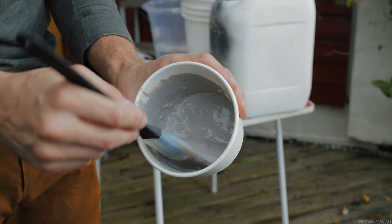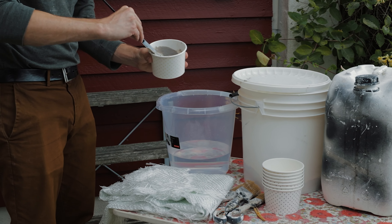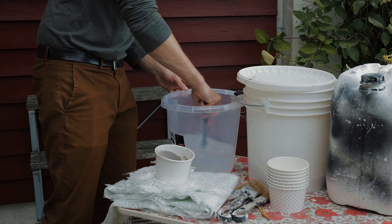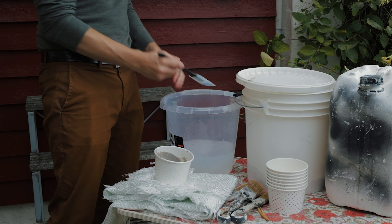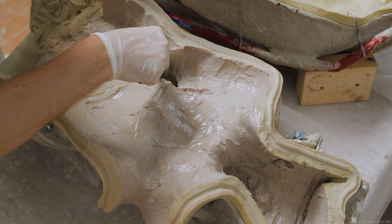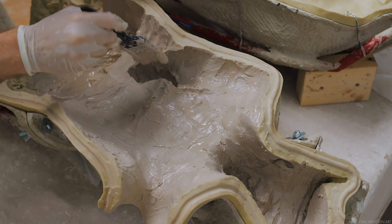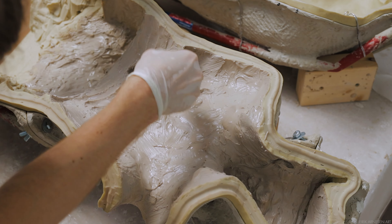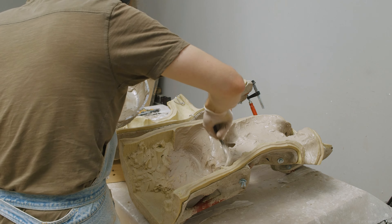You'll notice that in this video I'm not wearing a mask or other safety equipment other than gloves. The gloves and apron are there really only to protect my clothes and keep my hands clean, so that if I need clean hands quickly for whatever reason I can rip the gloves off fast and fix a camera issue or whatever issue I might have with the cast. I do work in a large open space, and the material is acrylic resin — it doesn't release gases or anything else that's nasty during its setting-up process. In that respect this is a much safer material than epoxy and polyurethane resins.